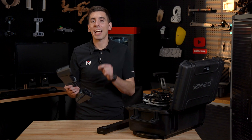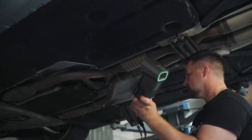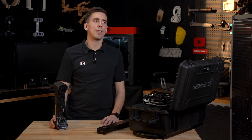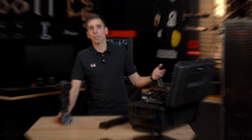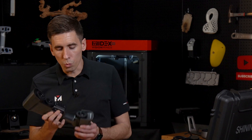But this scanner even has a 98 laser line mode. Its field of view is significantly larger than other scanners, meaning you can scan the entire underside of a car in half the time, simply because it covers a larger patch. Furthermore, with 98 laser lines, this is one of the first scanners that can scan with lasers without having to put reflective markers on your part. That's a really big deal — anyone who's used a laser scanner on a large object knows you have to place markers every 3 to 6 inches, and on a car that's a lot of stickers taking 5 to 15 minutes. Markerless laser scanning mode makes this an absolute game changer.